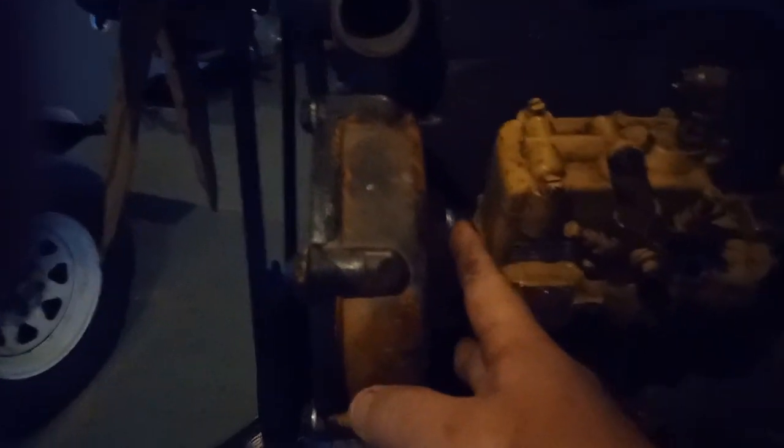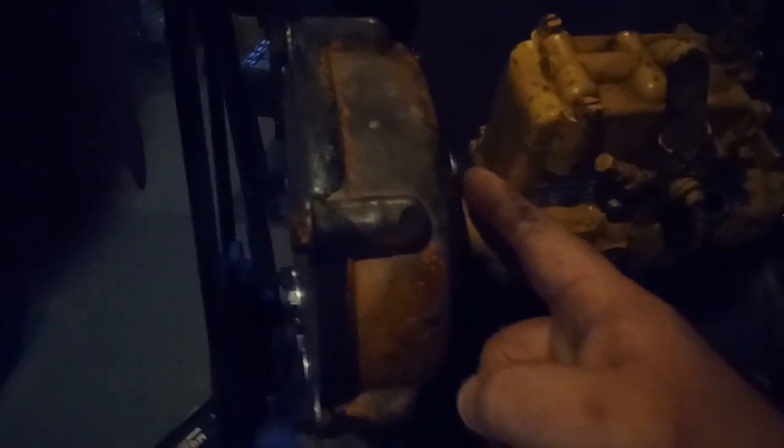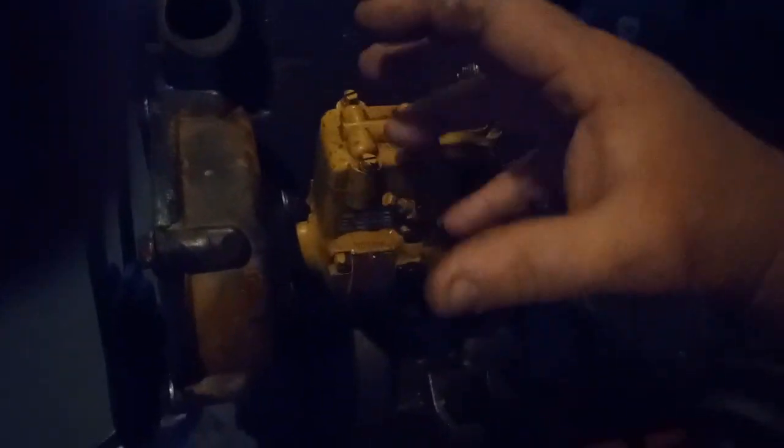These also get 30 pounds, but I put lock washers on them. I didn't torque down the injector assembly yet because I wanted to add a lock washer and a nut — I know that if this pump rotates at all it'll throw the timing out of alignment, so I want to make sure it doesn't move.